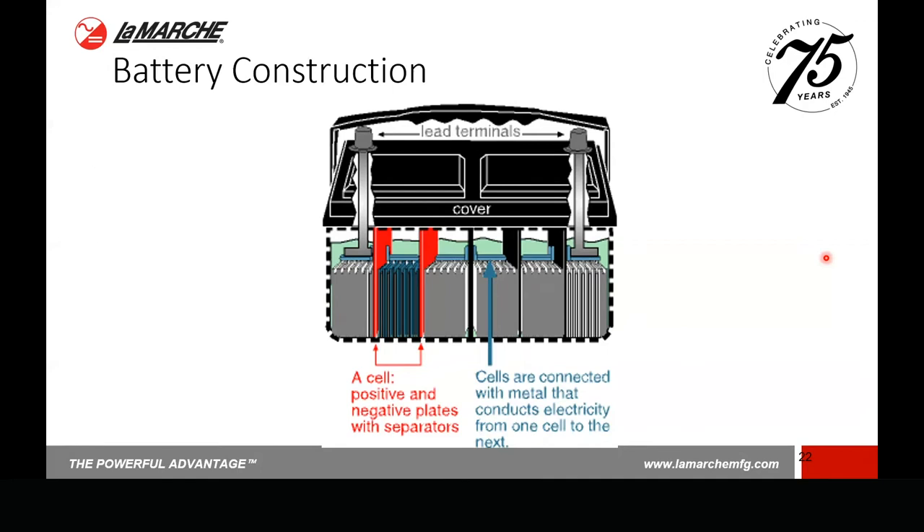Let's take a look at some battery types. There are many different battery types — the difference is basically in the chemicals they use. They all have different characteristics and properties that battery designers tailor to meet specific needs or applications. They may add certain materials like antimony, calcium, or selenium that give the battery different properties — it may let it cycle better (a cycle being a charge-discharge cycle), increase tolerance to heat, or give other beneficial properties. Lead acid is the most popular type battery still around today — over 120 years later. I always hear the traditional guys at trade shows saying, 'Lead's not dead.'